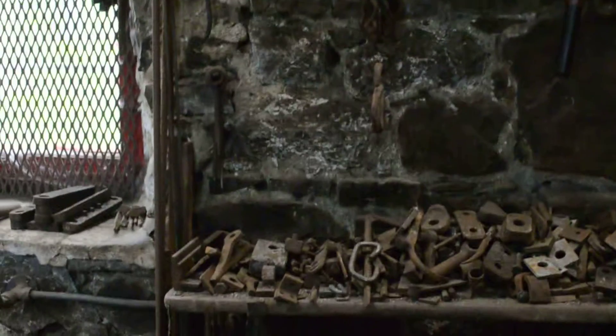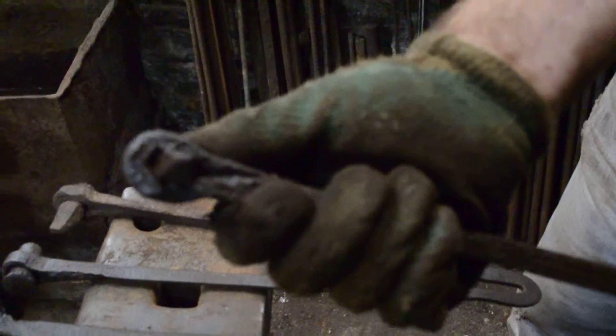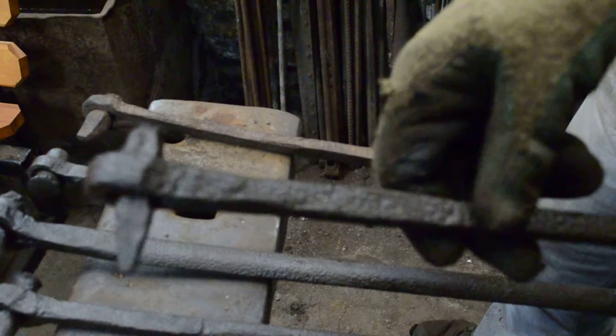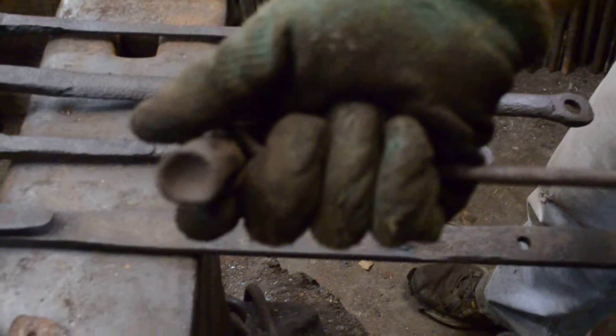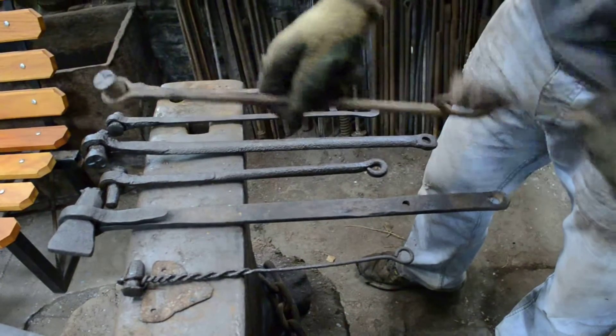This fella here was for nails in the horseshoe. You'd start off the nail with this - the mark for the nail - and then you follow through with a finer punch called a pritchel. And this fella must have been for the rivets - they used to make their own rivets. I'm guessing this was used just to even off the head when it was red hot. That was another shamrock brand - must have been a really old one because it's well worn.